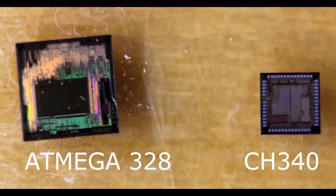That's your first observation you can make. The serial converter is actually a fairly large die, and gives some explanation as to why you don't often see USB interfaces on very inexpensive microcontrollers — the function takes a fair bit of die area.